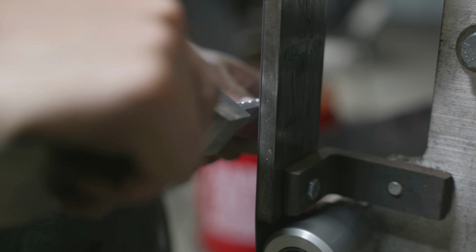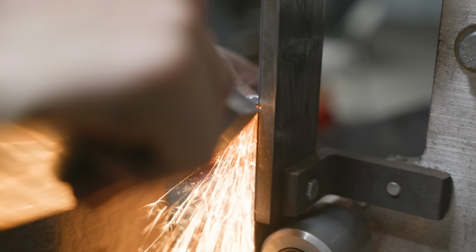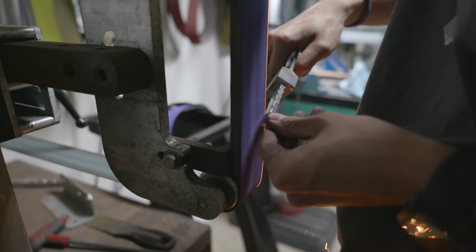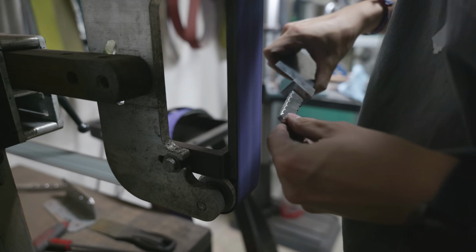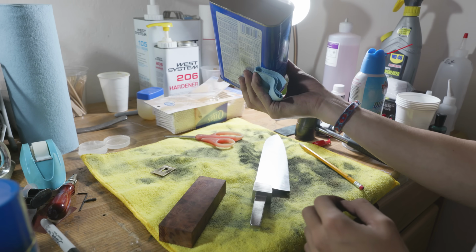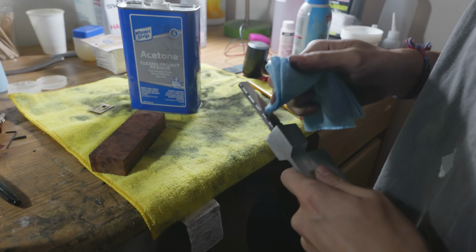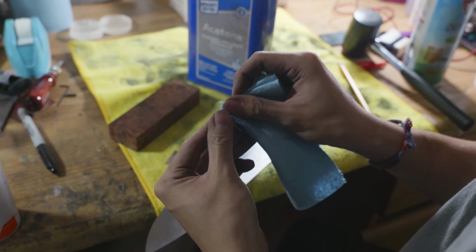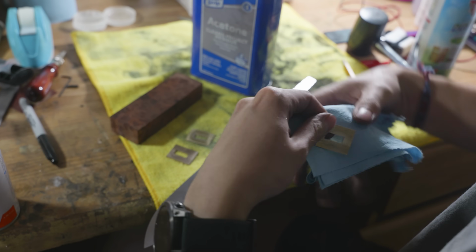That's what we like. Before the glue up, I make sure to notch the tang with some deep notches with the corner of a 36 grit belt. This will make it so that the handle never falls apart even without a pin. I feel like this is one of those life hacks for getting a stronger bond with epoxy. All you have to do is clean your pieces. If you have oil on your pieces, the epoxy doesn't bond as well to the pieces that you're trying to connect, and cleaning the pieces just makes it so that that's not a variable.